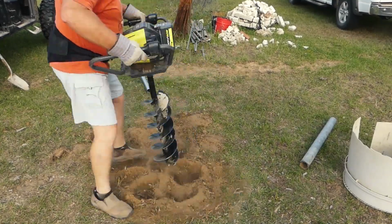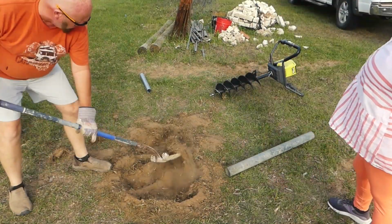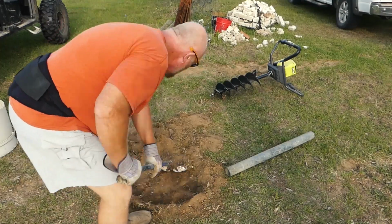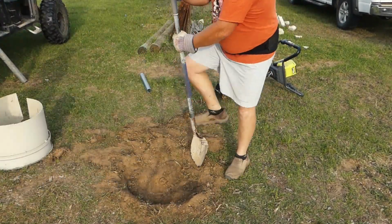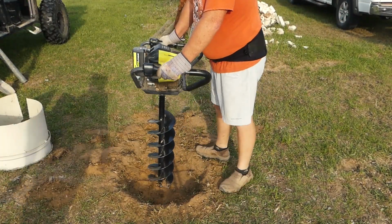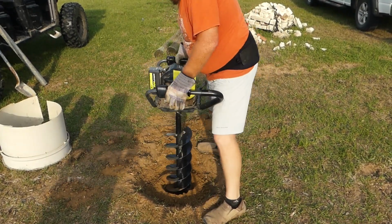So I take the auger into this rough Texas soil. Let me tell you, y'all, this soil is hard as concrete, and you're not going to dig it easily with a shovel. So the auger helps me. I drill it around and get 5 little openings there. The reason I use that template is the size that I make the round stone around a post, so I can stack stones in there and pour concrete, and it'll be just fine.